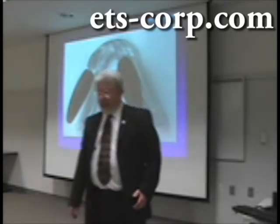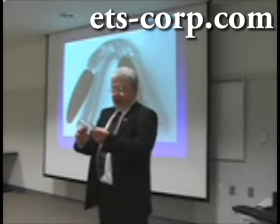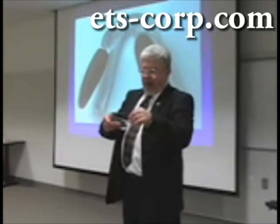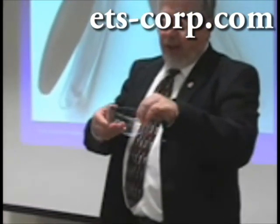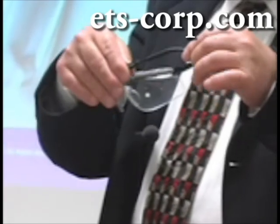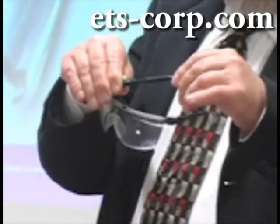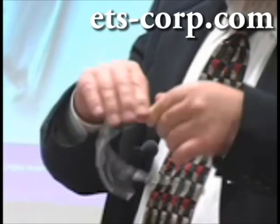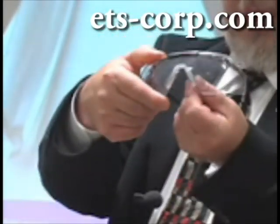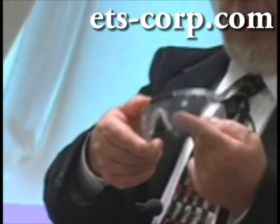I have the glasses right here in my hand. This flex turning is taking place in the tool — it's made in the tool. The adjustment of the earpiece is the TPE part sliding over the acetal part. And we also have the nose piece, which you can see how it's moving. This is achieved also in the tool.